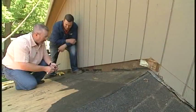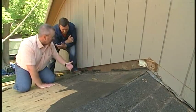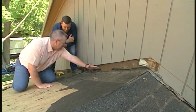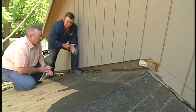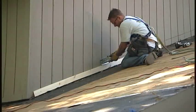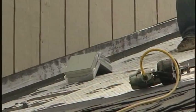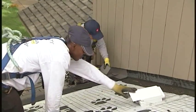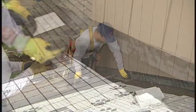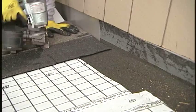The old material is brittle and just falling apart. With little or no insulation due to the era of construction, where this roof meets the wall is a perfect area for moisture to get in. To create a drainage plane, they cut out six inches of old cedar siding, run ice and water shield behind it, and take the shingle tins right over the top for a nice step flashing — so even if there is an ice dam, you'll never have to worry about it leaking. Peace of mind for the homeowner.